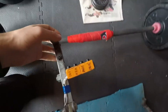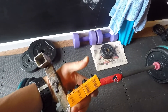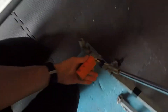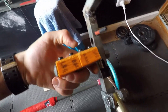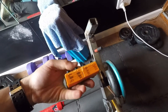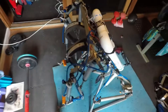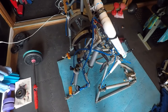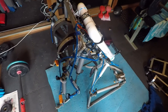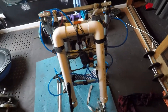The controls: I've got four buttons on this side and four buttons on the other hand, with two additional buttons on this hand that are currently not hooked up to anything, but the option is there. On one side I have shoulder, arm, back, and leg; on the other side I've got the same shoulder, arm, and two miscellaneous buttons. These are all latching switches — press them and they stay on, press again and they come off. Pretty much the cheapest and easiest control system I could do. The first iteration of the suit used an Arduino for all the control systems, but it was pretty buggy. I was going to use a bunch of different sensors but the price started going up real fast and I just didn't have the time or the money for that.